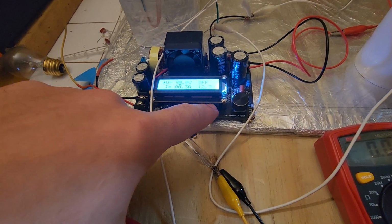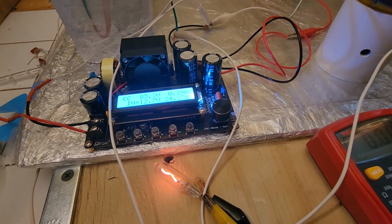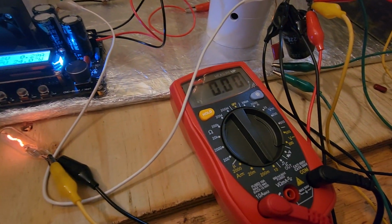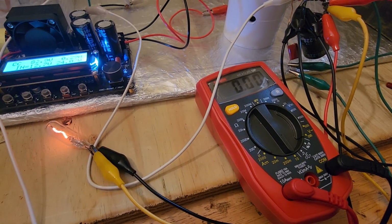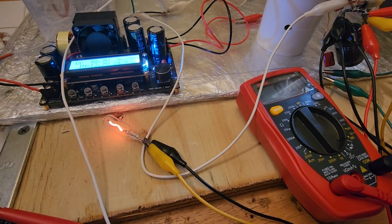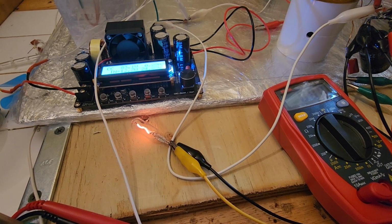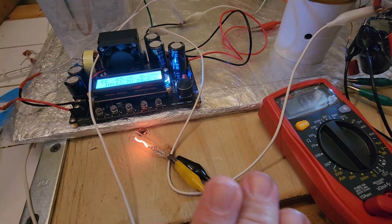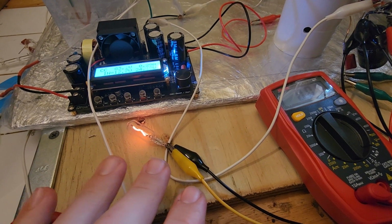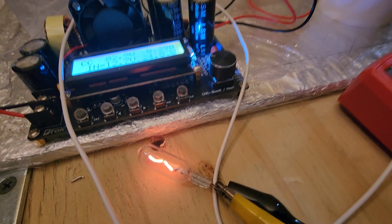And I found out that tuning the system, you're much better off tuning it by the brightness of a high current draw incandescent bulb. Don't have your meter hooked up to it in current mode and just measure the raw current that way, because you will get misleading readings. You want to hook up a nice fat heavy incandescent bulb, and when you combine your power output receiver circuitry, the DC of it, try and keep your voltage the same across the circuitry, and no matter what kind of current you have, keep combining it, and it will add up and it will get your bulb very bright.